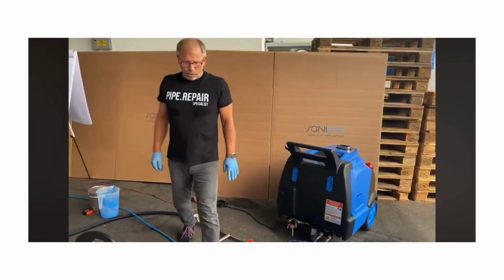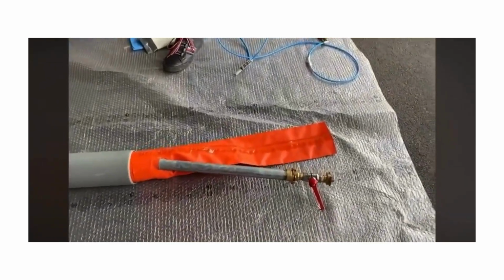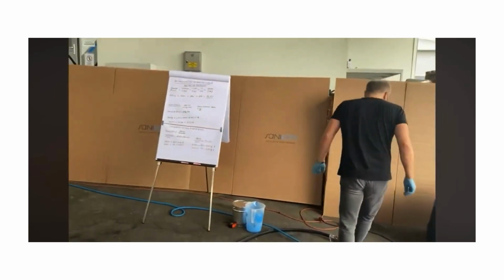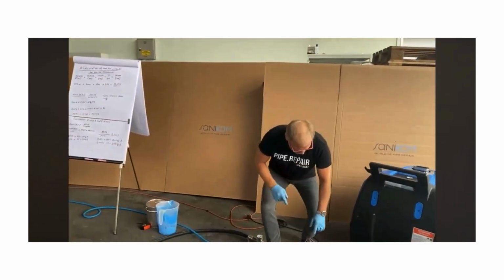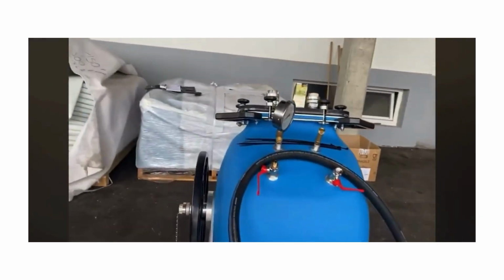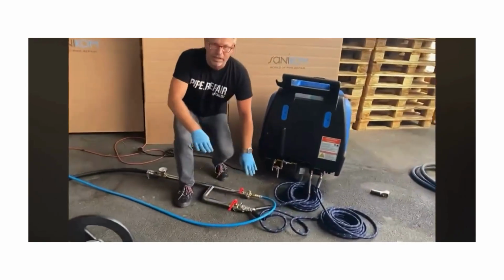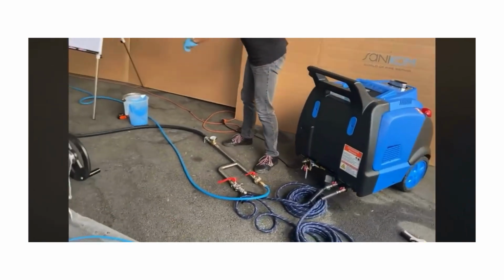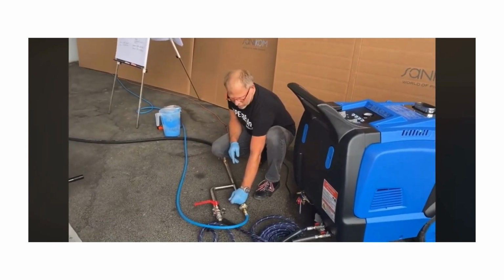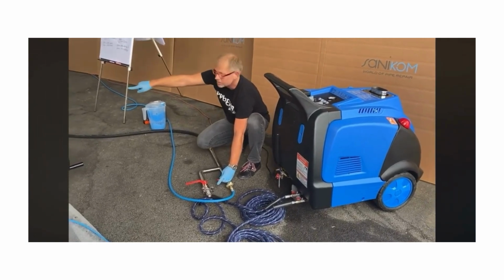Okay, now we put in the steam outlet pipe and we open just a little bit. And now it is important to keep the pressure, as we said, 0.3 bar. And this I regulate here at the steam mixing unit. That means I come in with my air, go through here, through the steam adapter into the drum.